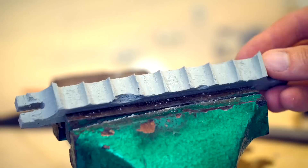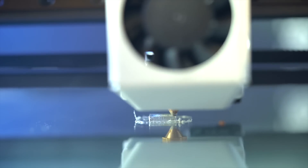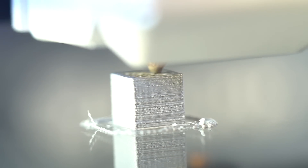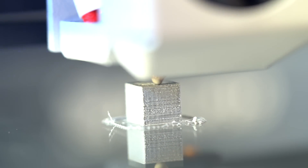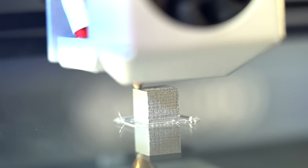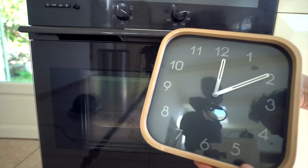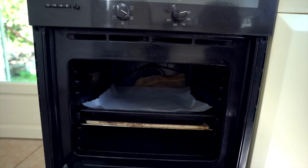As a beginner it's hard to really know what to look for, and I tried a lot of calibration steps with compromised filament. It was kind of frustrating because I went back and forth with fine-tuning settings and I never got it good. Then I stumbled over some videos about keeping your filament dry from moisture. I tried baking it in the oven at 60 to 80 Celsius for about 5 hours — and it was night and day afterwards.